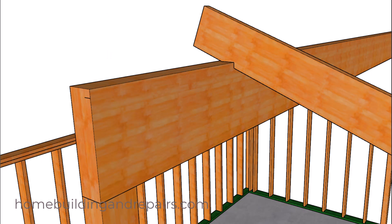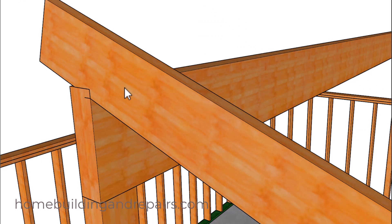The first thing we need to do will be to create the height of our seat cut — this measurement here. I won't be able to provide you with that specific measurement. However, as long as this part of the rafter is sitting at least two inches on top of the beam or wall, whatever you're working with, then you shouldn't have a problem. You might need to check with local engineers and building authorities to verify all of these dimensions.